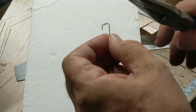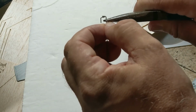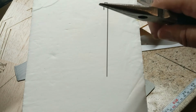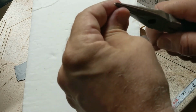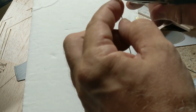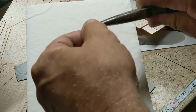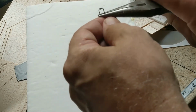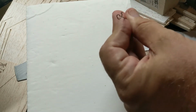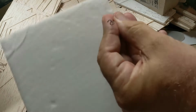And now you want to put this tail facing away from you and measure out approximately the same distance and bend this wire 45 degrees right towards the other tail. Okay, so now you have a situation like this. Come about roughly 1/8 of an inch. You want to get that centered and bend it back just the way you just came from. Give it a little tweak here and there, you've got a satisfactory reverse S hook. Nice square corners, everything's nice and neat.